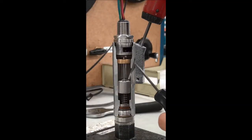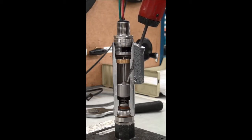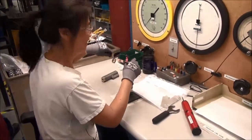The set point of the pressure switch can be calibrated by the adjustment screw. By lowering the screw, the range spring is compressed, making the force required to move the piston increase, thus increasing the pressure range of the switch. Based on received set points from customers, full calibration is done during factory assembly with no extra charge.